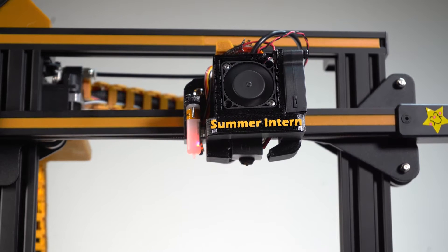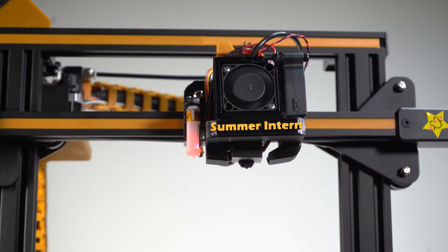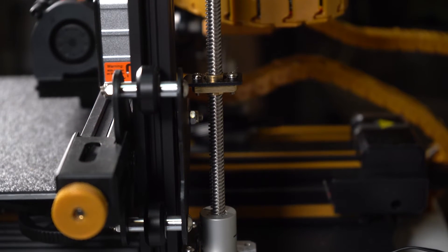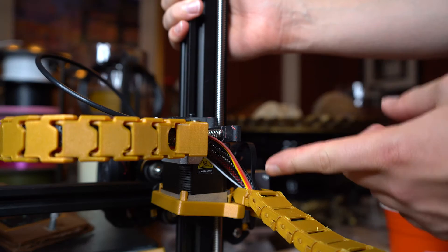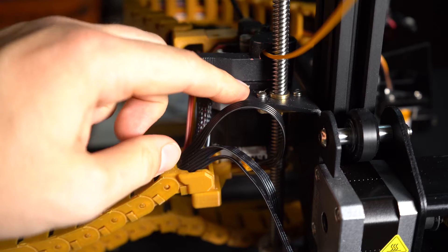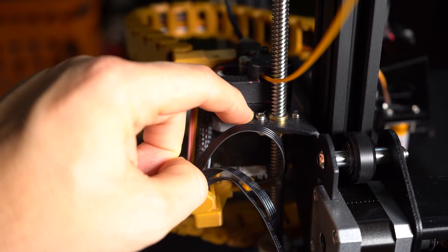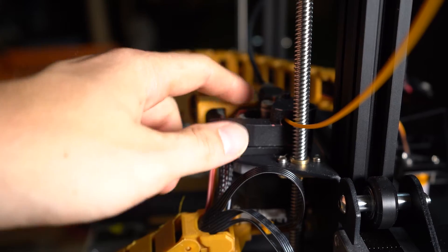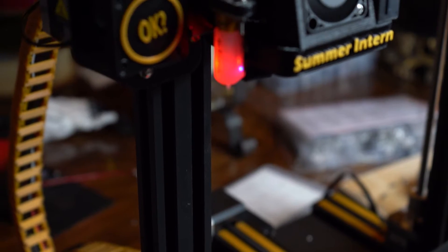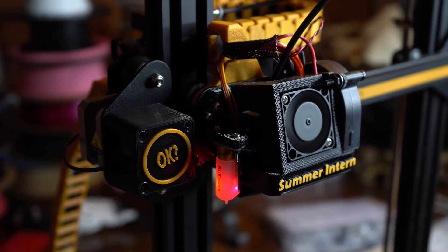An unlevel gantry will screw up your parts, creating lopsided prints or causing the entire print to fail. Dual Z-axis installation helps tremendously by removing the cantilever on the stock Ender 3. But one issue I kept running into was my gantry being slightly unlevel after changing the filament. Applying downward force to the left side of the gantry, where the extruder is, causes that side to sag disproportionately to the right side. So when I was holding open the spring clamp that meshes the extruder gears together, I was also pushing down on that side of the gantry, causing that side to sag.